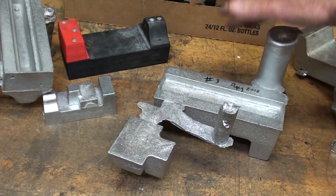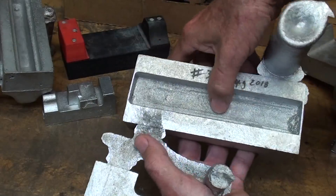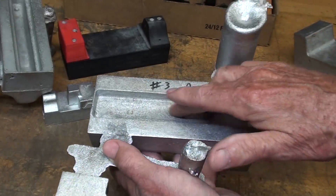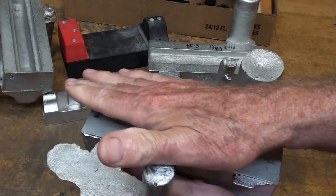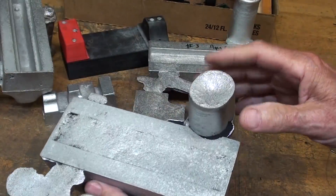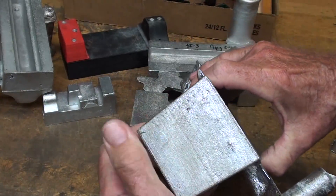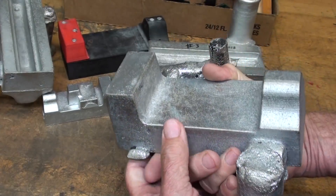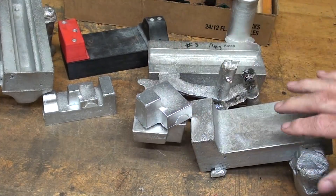This was also a variation — I filled this with sand ahead of time and cast it that way to try to eliminate the depth so it would withdraw better. And here's one that I just cast solid; there didn't appear to be any appreciable shrinkage, and I did have a big riser, albeit in the wrong position, but it was successful enough. You can actually see the 3D printed layers reflected in the casting — visible right there on the casting surface.